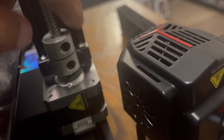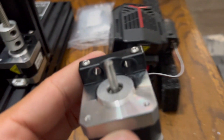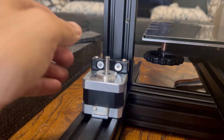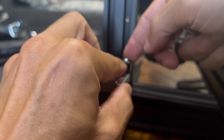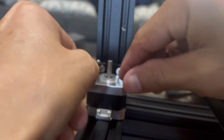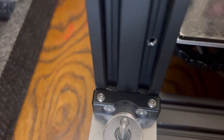We're going to be putting another stepper motor on the left side of the printer with the same hardware and brackets. On the side with the original stepper motor there are two pre-drilled holes for the screws, but on the other side there aren't — just a hole that fastens the power supply, which we're relocating anyway. Using the supplied hardware, lead screws, and bracket, screw that into place onto the Z-gantry. Grab the stepper motor and bracket, fasten them together with the recommended M screws, then take the lead screws and the square anchor nuts, line them up with the channels on the Z-gantry, push into place, and tighten so the stepper motor is firmly mounted.